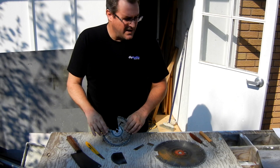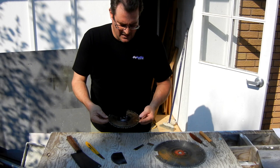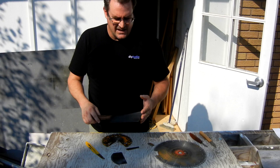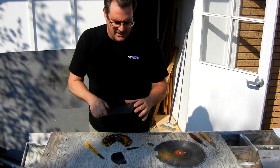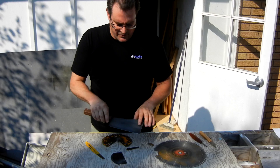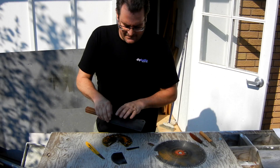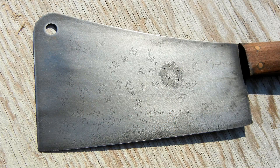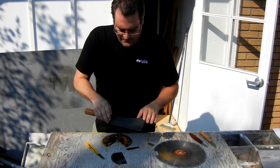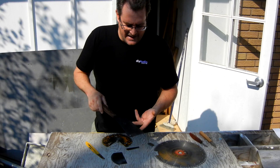I know mild steel when I cut it, I know mild steel when I work with it. And I was very surprised when I read that many knife-making guys think that these are mild steel. My cleaver is made from a 10-inch carbide-tipped saw blade, and it's holding up really well. The steel is very hard — I didn't harden it. I have etched the blade in hydrochloric acid, and that brought out the pattern in the steel. It also made the surface more receptive to oil — it opened the pores so that when you oil the blade, it absorbs in and keeps it from rust. It takes a very keen edge.